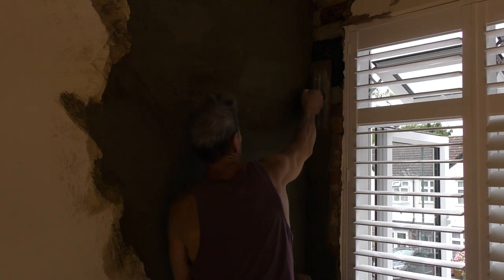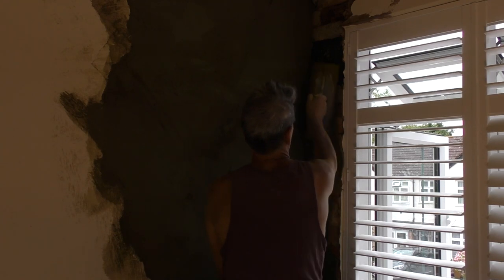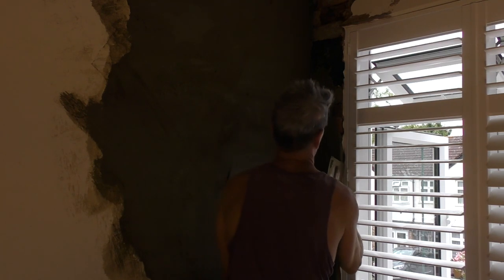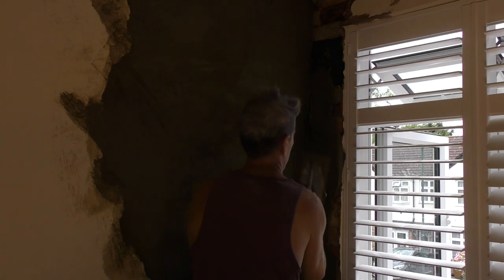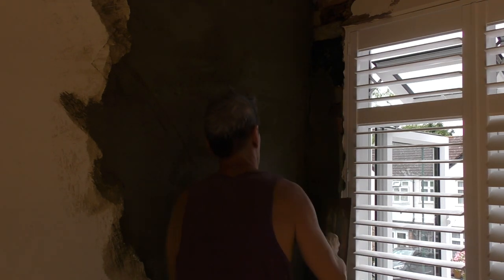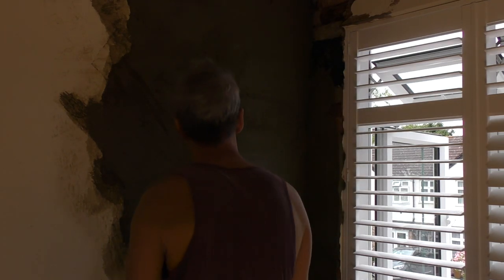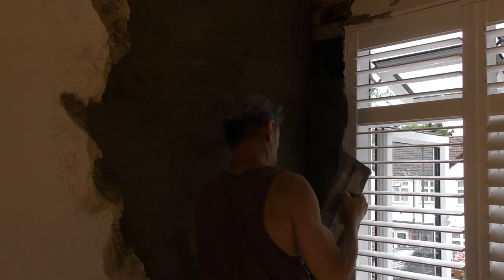Okay here we go. On an angle like this, as I said there's no actual corner that I can pull out to. So what I'm tending to do here is getting the stuff onto my trowel and using the heel of the trowel - you're pushing that on and going upwards. The heel of the trowel is pushed against the wall and the toe at the top is away from the wall, so you're basically pushing the cement up the wall using the heel of the trowel.